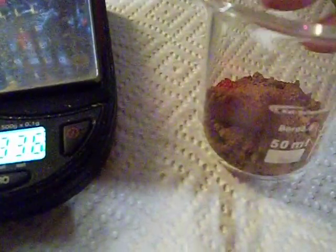It wasn't quite an ounce — it was almost exactly the 25 grams that I used. I used 24 mils of nitric acid to complete the dissolution, and then I used 25 grams of sodium metabisulfite to drop it. It looks like it was just very nearly exactly what it should have been.